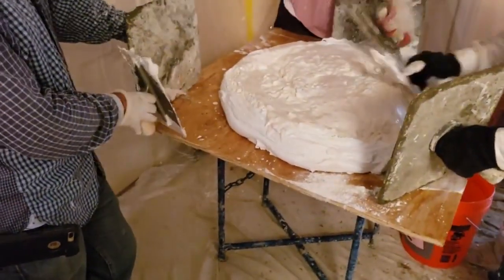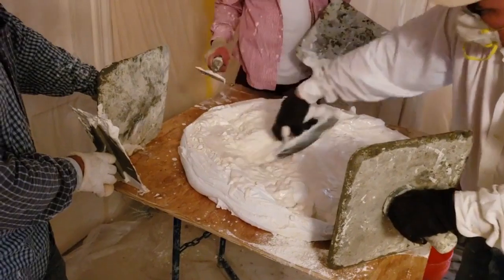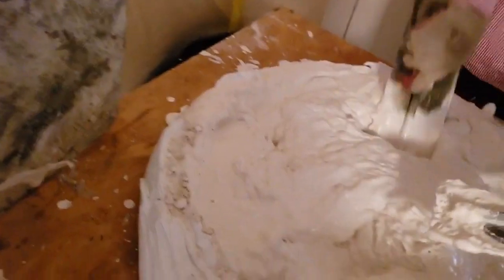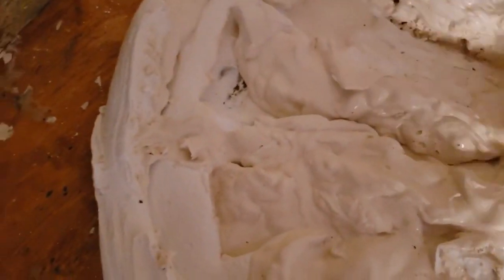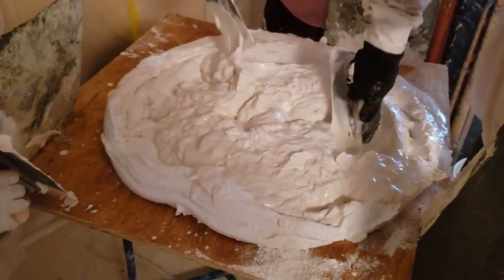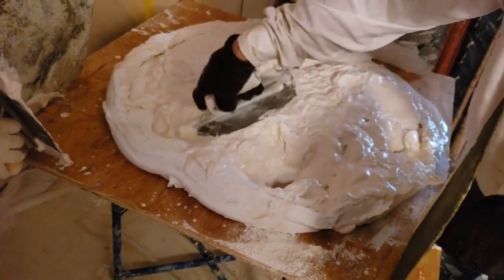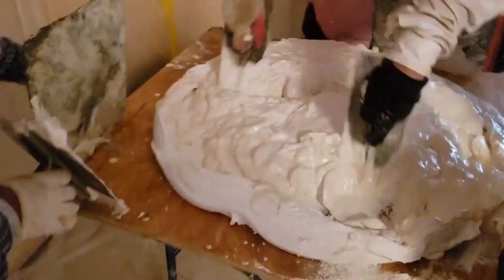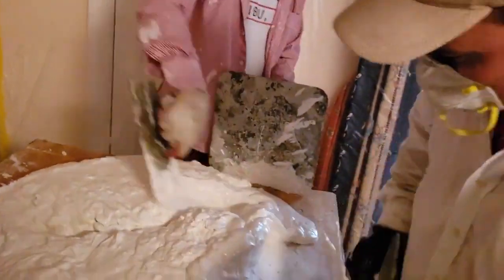You should be able to do this on a red carpet without getting a drop of mortar on the floor — though I'll put a drop cloth down. We're beating the lime ring into the molding plaster. Notice we can cut another ring to keep mortar from running into the floor, then beat that into the center. The method is mash, mash, mash — mash it down to the board every single time. When it's fairly well mashed up, no need to get it really super perfect. We don't want to over-mix it: the longer you mix this, the faster it sets.